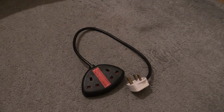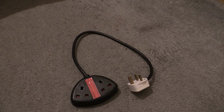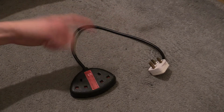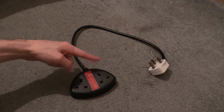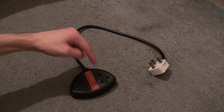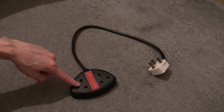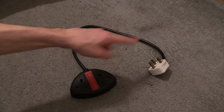Inside that trailing socket there, I've just given it a bit of jigging and poking. And what basically happens in there, in the classic style of a Fun-Jiggery-Pokery Unit, is this plug here. You put that in the wall socket as per usual. And in these two sockets on here, I've reconfigured them inside so that they are in series. This one is where you put the ballast in, and this one over here is where you put the load in.